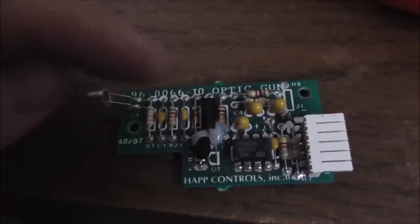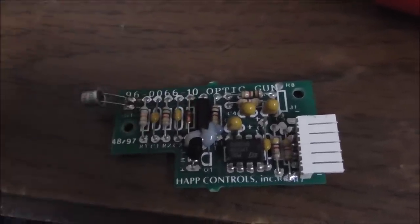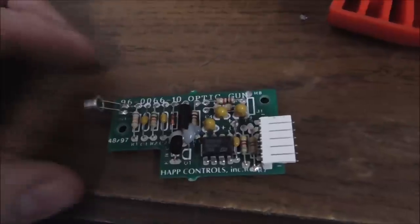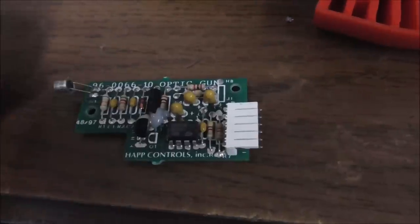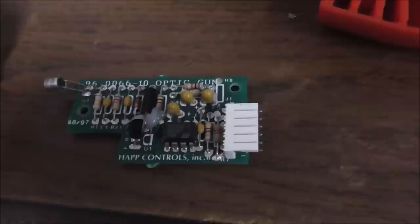So I'm getting 42 ohms, but this one, which has some glue on it, so maybe they've replaced it at some point and put a different part number in it, is something like 1.8 megs. So that's 42 ohms or 1.8 megs. That's way up there. That's not even K, that's megs. So maybe that inductor's bad. I don't know. I've never fixed one like that before.